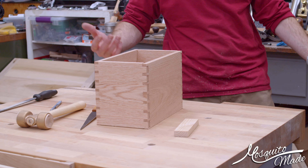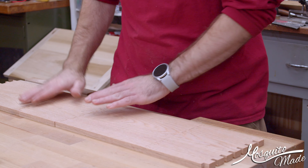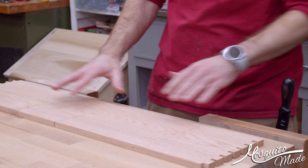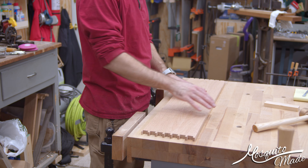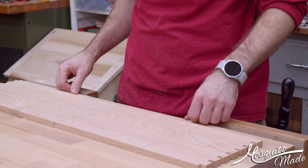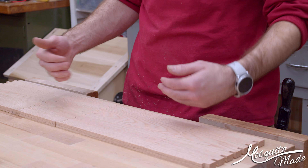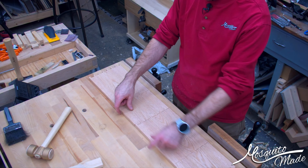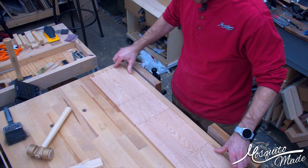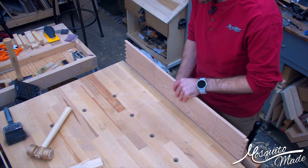And there you have it — well, almost. Got a lot of it done anyway. The neat thing about these that I've discovered is that since they're not dovetails, you can actually lay them out flat. I've got them all end-to-end where they're supposed to be. Because I used the wrong end of the block, what happened is basically both of these started a little bit too far away from that pin, so these are a little bit lower and these are a little bit higher.